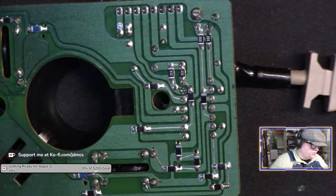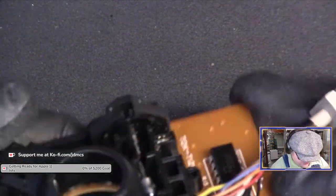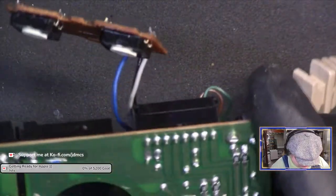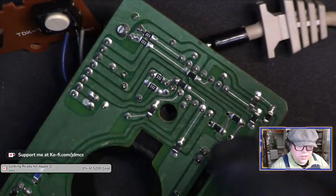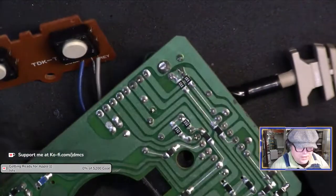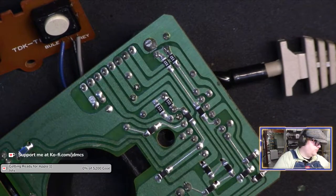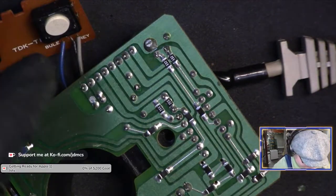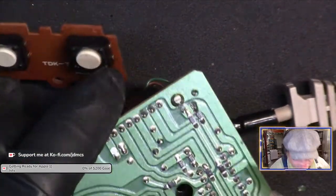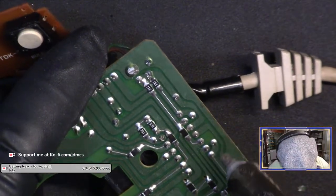So instead, I'm going to attempt to replace this chip on the mouse, because if that's not it, it's the encoder wheels, and that's a much harder repair, because first of all, I don't know what the part is for those sensors. If I can't repair this tank mouse, I'm just going to have to use the modern adapter. As much as I wanted to use the tank mouse, because the tank mouse is Amiga. Nothing says Amiga more than tank mouse. It's just like the original. It's just like Jay and his G3s with the puck mouse.